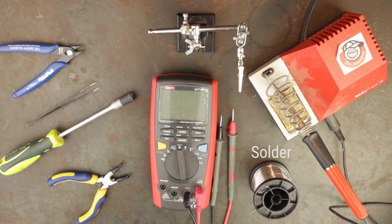The sponge is kept damp during the project and used to keep the tip of the iron clean. Using the correct solder will make a huge difference to how easy and enjoyable your DIY electronics experience will be. Without a doubt you should be using leaded solder. Lead-free solder has a much higher melting temperature which can lead to damage to solder pads and to components. You want solder with a gauge between 18 and 24 AWG. If you go to our soldering video there will be more information on solder, soldering, and soldering irons in general.